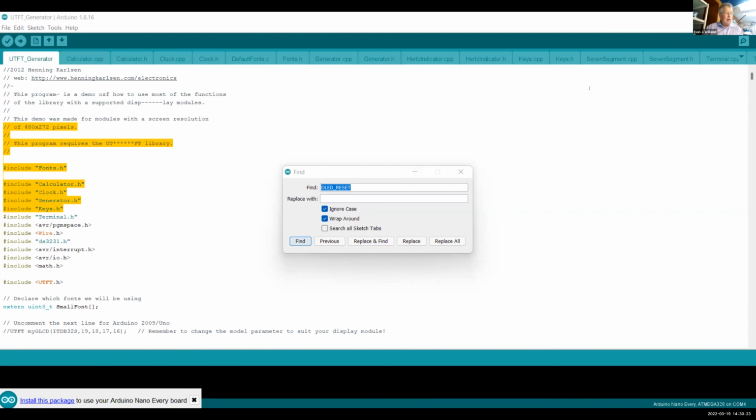But I have looked at other boards. There's boards for signal development, Red Pitaya and stuff. There's better DSP boards. The Arduino does do digital signal processing, but I think there's some limits to its speed because it's only got a 16 megahertz clock. So I looked at the TI boards. Texas Instruments has some wonderful boards there. And then of course, if you're in Raspberry Pi land, there's Banana Pi and all that stuff.